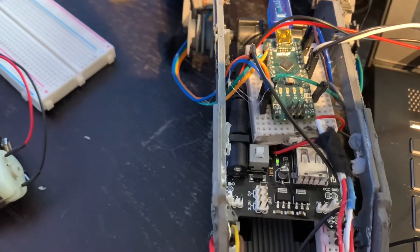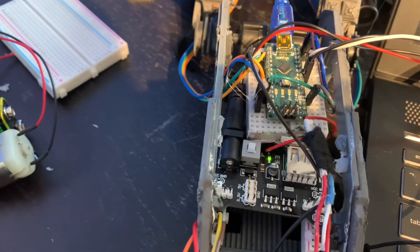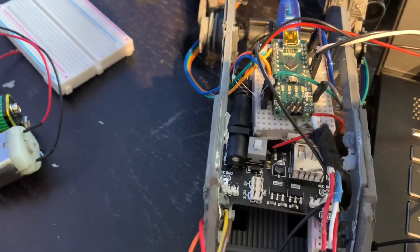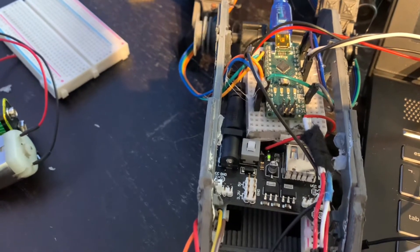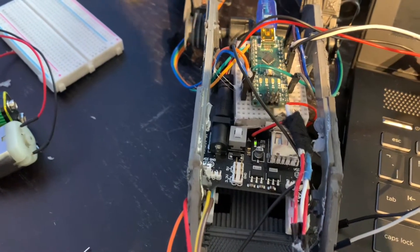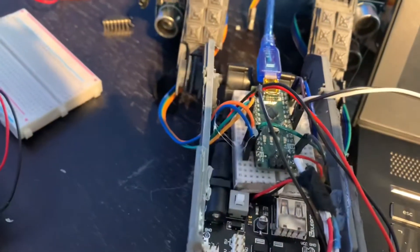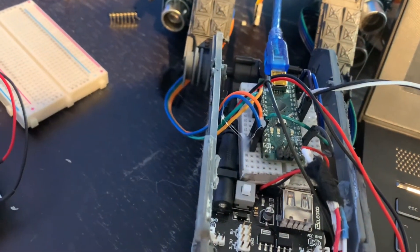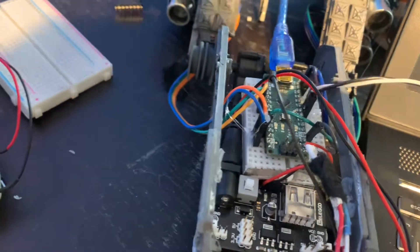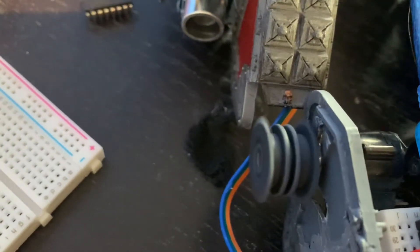I've found quite a problem. I have one of the motors plugged into the power distribution board and when I bring the voltage up to 9 volts, it stops. I'm pretty sure there is too much load through the board for one of these motors, so I'm going to have to find a way around that and probably get rid of the power distribution board. When I manually plug the wires onto the little power distribution unit, I can increase and alter the voltage direct to the motor and it does work — going all the way up to 9 volts it runs at quite a speed, which would definitely be fast enough and provides torque. It's pulling about 0.2 of an amp.